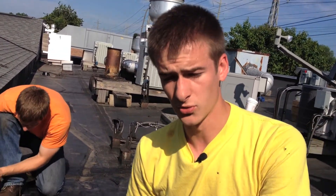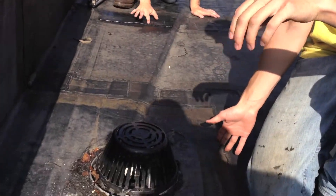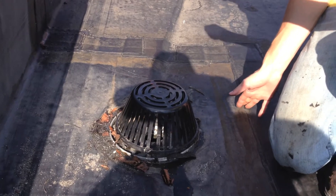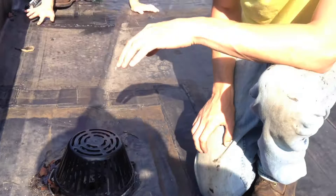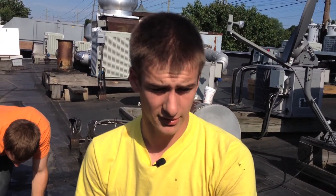That's why we don't recommend this roof. Another problem is this membrane tears so easily. If you were to drop a tool on it, you could make a small tear and you wouldn't even see it, but you would definitely see the leak on the inside. This is why we don't recommend this type of membrane on this type of roof.